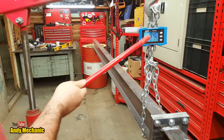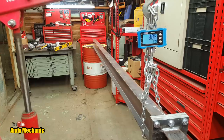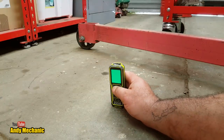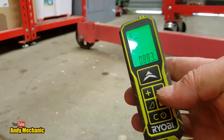So now we can remove the support and take another reading to see how much this beam deflects. No support — 883 millimetres. So according to the calculations and the readings just taken, we've got a 4-millimetre deflection. That's a 4mm sag in that beam over a 5.7-metre distance from one oil drum to the other — replicating the width of the garage, or the mounting points at least of where this beam's going to be fixed.